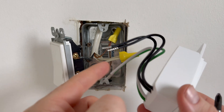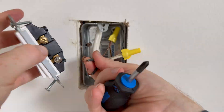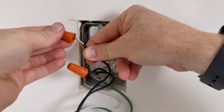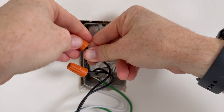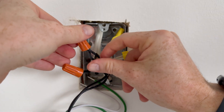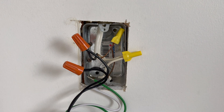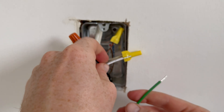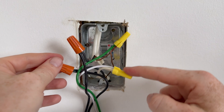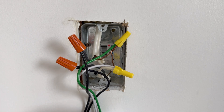The neutral is white, so we're just adding that in there. It's basically just adding everything together — tying those wires together. Make everything straight, line them up as close as you can, then twist them together. Afterwards, wrap some electrical tape around them just to make sure they stay on. We're going to do the exact same for the other connections. We tied this one, this one, this one — electrical tape is just for safety.